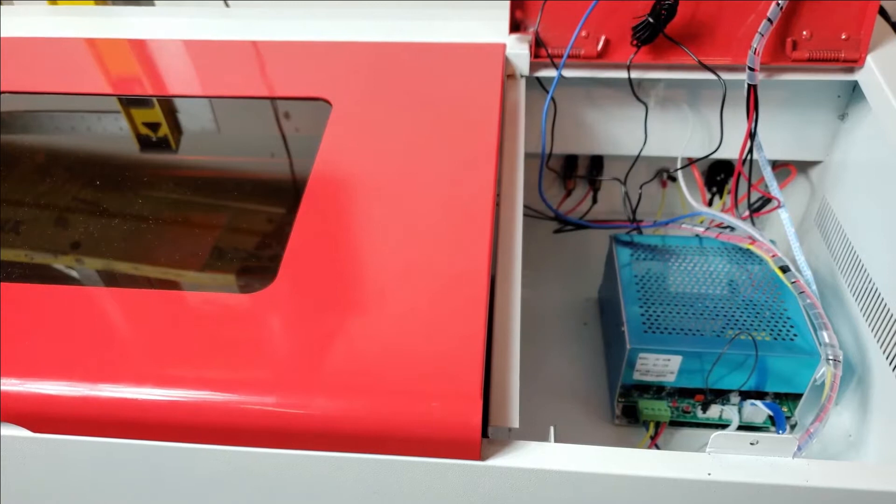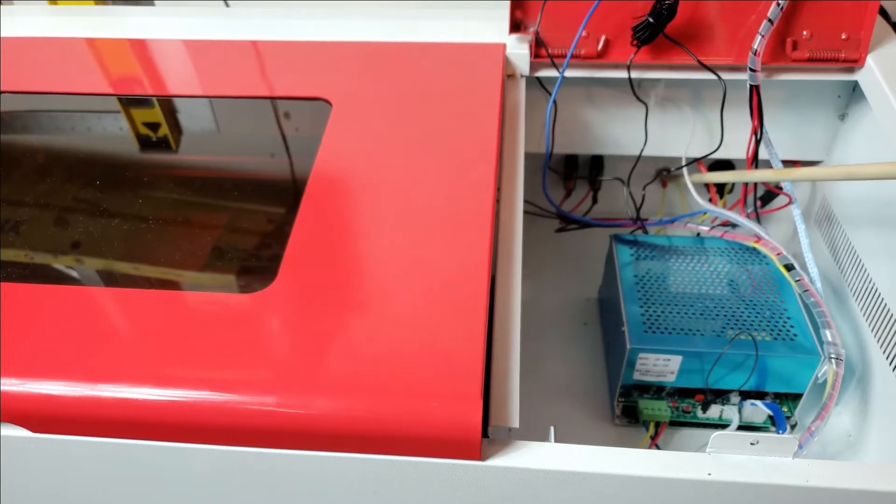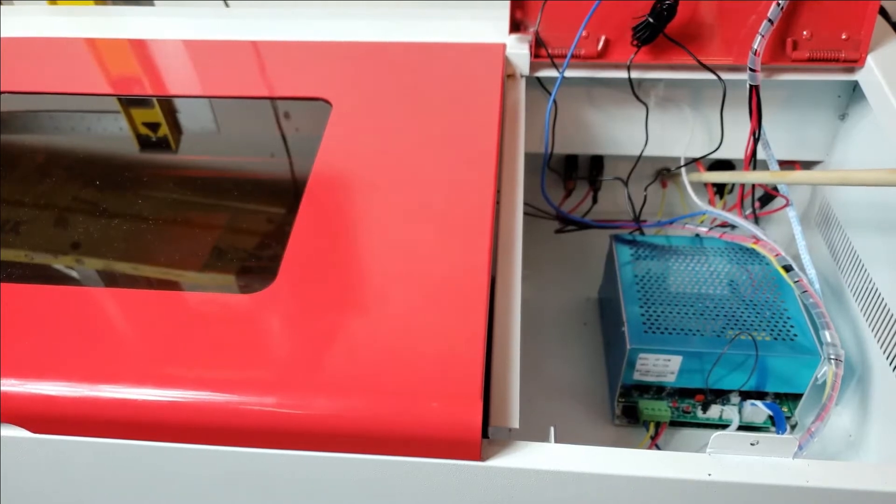Back in here, this is where your case grounding happens. What you need to do is strip this all apart, and on the inside here and on the back side, sand away all of the paint so that everything touches bare metal. That will ground your case properly. If you don't do that, you're probably not going to have a very good ground.